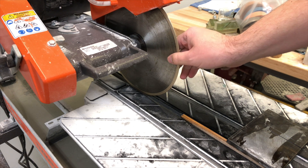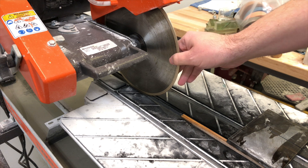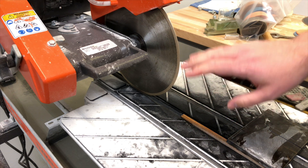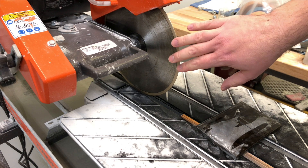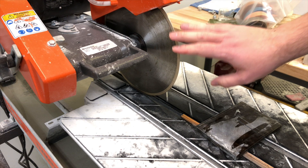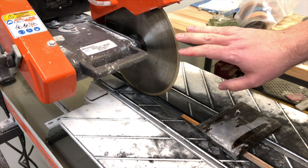The SuperLock Glass Plus blade is a fine grit diamond blade meant for cutting thinner glass materials. It's going to have a much harder time going through thicker glass and will wear out a lot faster if you try. Even going through thinner glass, the fine grit SuperLock blade will have to be dressed more often than a medium grit blade like the MK303 or one of the Result blades, which will take far longer before needing to be dressed.